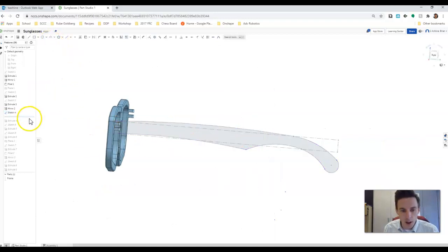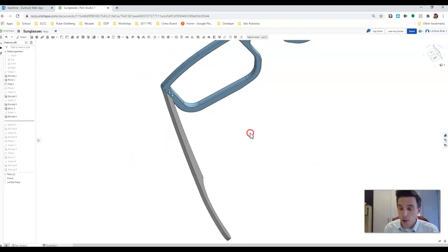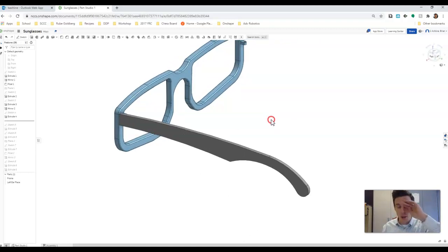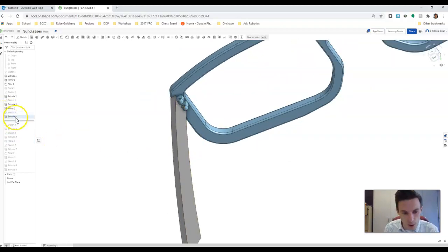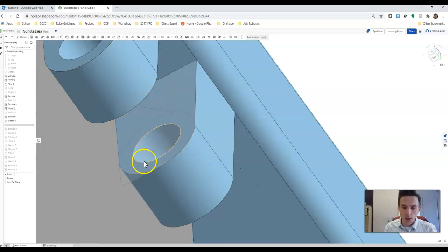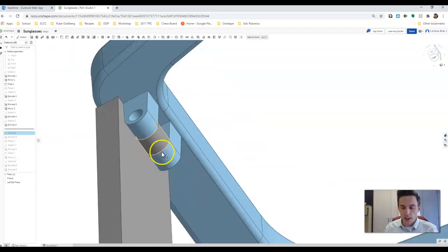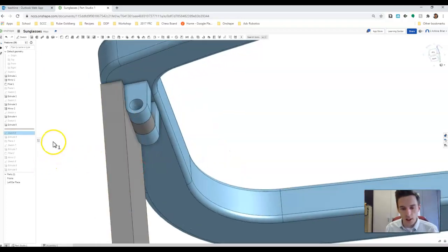So then from there, I extruded that thing. So here's my first extrusion where it just comes back straight. And again, for most people, this would probably be fine. You still need to include your hinge piece, but it could be straight just like that, so there's nothing wrong with that. From there, I started drawing my hinge piece in, and I extruded that hinge piece up so that it created the centerpiece of my hinge.